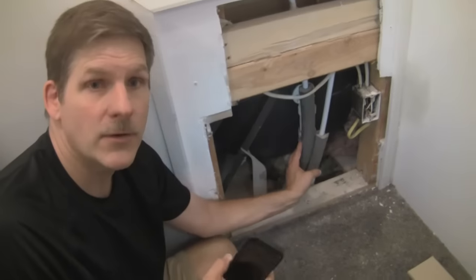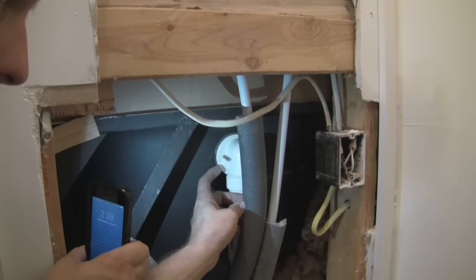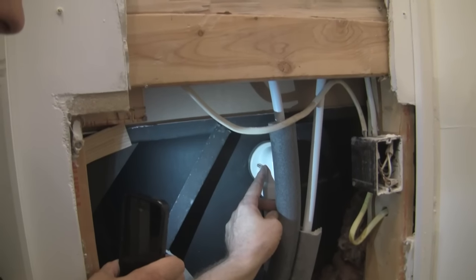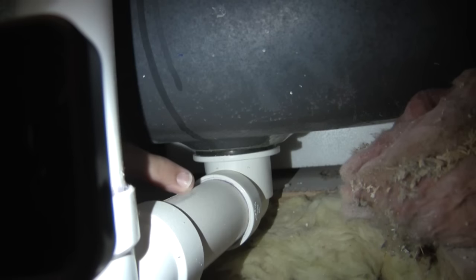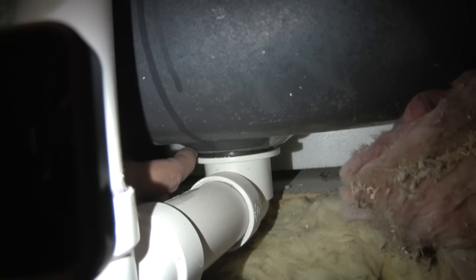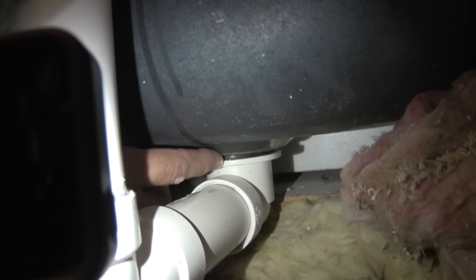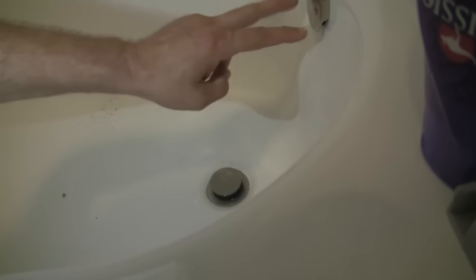Here's the pipe that we made in the garage, and here it is all assembled and in. There's a rubber gasket between the PVC elbow and the steel tub. There are two screws from the inside that go right through the overflow cover into this PVC elbow. On the bottom, this is all the PVC part we assembled — it has another elbow that goes up, and it also has a rubber gasket. The drain on the inside of the tub screws into this elbow and is sealed because it has a rubber gasket. It's super easy to put in once you get all the measurements correct — and that's the hard part. The overflow cover screws into that PVC, and underneath there's a gap so when your water gets too high, it just flows underneath and into the overflow tube and down.